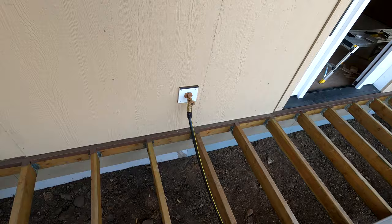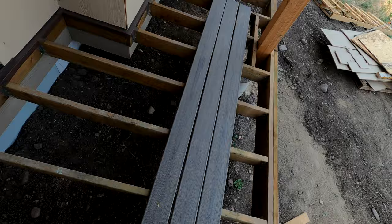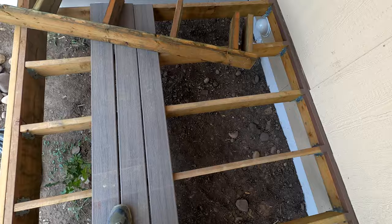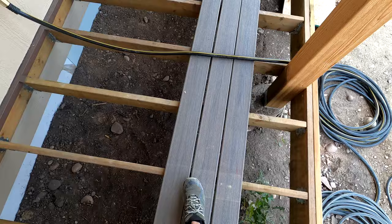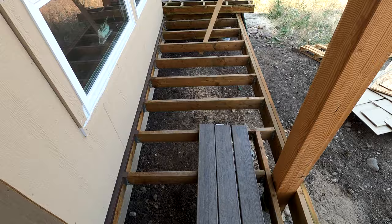There's not much I can do today other than get those ladders in. I have these three pieces of Trex and four more over there. But my goal is to get this crushed rock underneath here before I put all my deck boards down, because it's just so much easier to throw it through the top right now as opposed to trying to crawl in from underneath. So I'm going to put some fabric down and try to get all that rock down in under here.